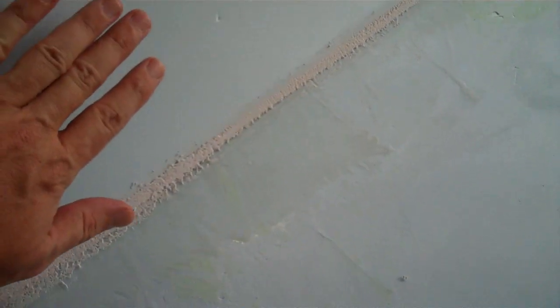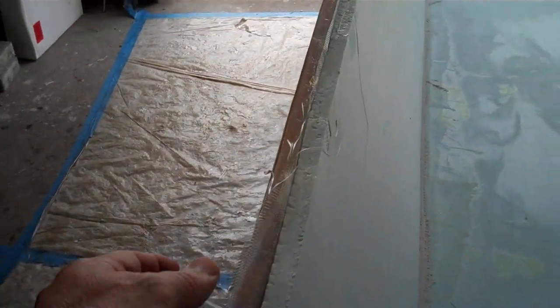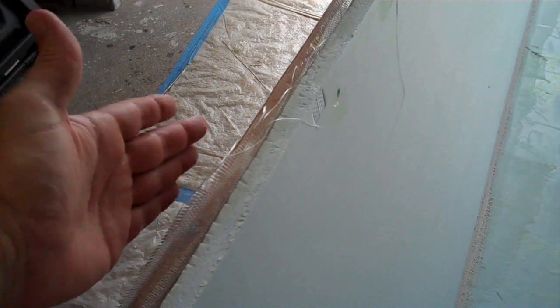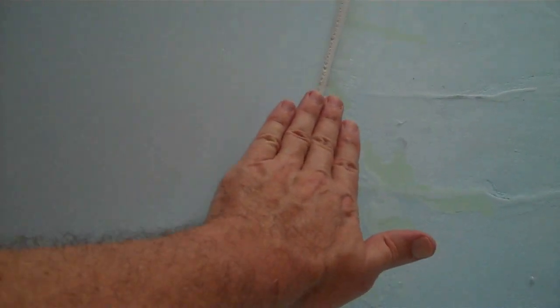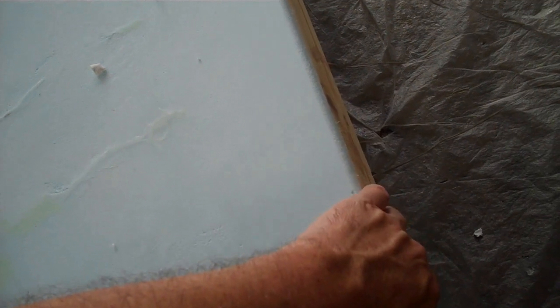It's not my prettiest job of filleting, but it's a lot better than a big open gap. Once I get in there with a sander after it dries it'll look much better. Really, this is just so the fiberglass cloth as it comes down will go around nicely — it's not primarily for strength. While the glass bead epoxy putty is drying, I'm moving to the top edge. I need to cut off the fiberglass cloth sticking up, round over the entire top edge on this side, sand the whole thing flat, then take a piece of fiberglass cloth starting two inches down, wrap it over the nicely rounded corners, go down around the filleted edge, around the rounded corner, and end on that piece of wood.